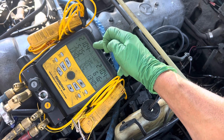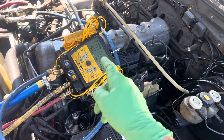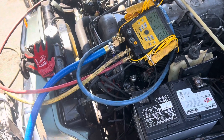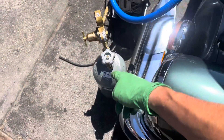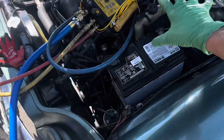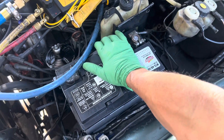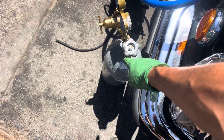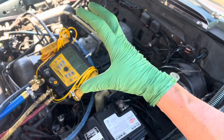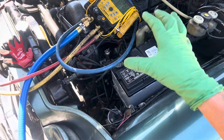If you waited and kept going, an analog needle would not move perceivably to a human eye, and you'd wonder: is it a leak, or is it because the gas was hot sitting in or on top of my car? If the gas bottle is 115 degrees but the car inside the shop is 60 degrees from sitting overnight, and you pump a 200-degree gas into a 60-degree car, the gas is going to start changing temperature and cooling, and you'll start noticing the psi go down.